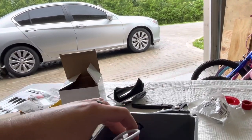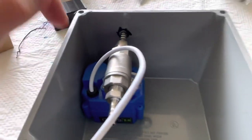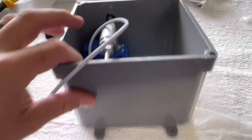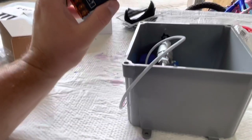What I did is set this down in here, put the plate to the plate, kept it tight, and took a marker and marked around that on both sides. Then I'll run a small drill bit through and come back with a paddle bit to get me to a quarter inch — that way my line goes through.